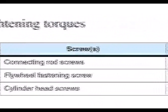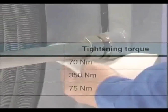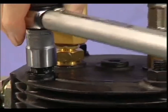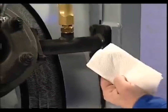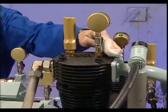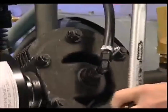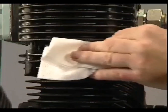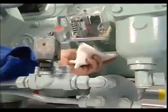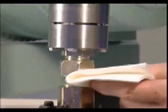The required torque can be viewed in the operating instructions at Chapter 8.4. All threaded joints must be checked for security and for any leakage using a white, lint-free cloth, and retightened as necessary. Items to inspect include: the cooler and air ducts, cooler supports, threaded joints for pipes and hose lines, monitoring gauges and sensors, cylinder heads and cylinders, electric motor and intermediate flange, bearings, protective switches such as temperature or oil pressure, accessories and equipment such as HP flexible hose with non-return valve and any connecting flange.